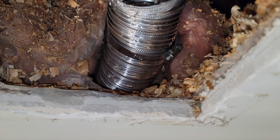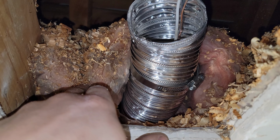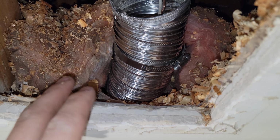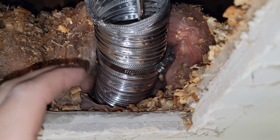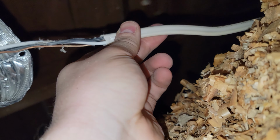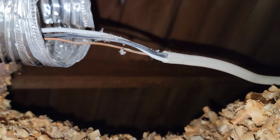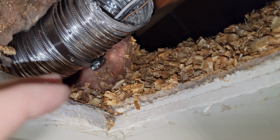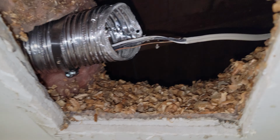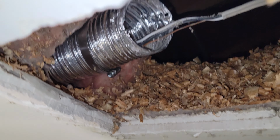This bathroom was renovated in the mid-90s, and there's a couple hints that someone's been in here before. Namely this insulation someone's put in there, it looks like. I'm assuming that maybe this bathroom didn't have a fan originally, or maybe it was a different type, but this insulation is kind of an indicator. This Romex wire is a bit of an indicator because it's white. All the other Romex in the house has got this older type of sheathing that's kind of a fabric style. So someone might have been in here at one point and installed this fan in the 90s, but that makes our life a little bit easier because we know this ductwork is already plumbed out to the soffit, and then we've already got good constant power here. So let's just open up this hole and we'll throw in our new bracket.